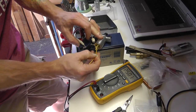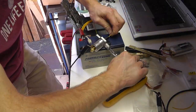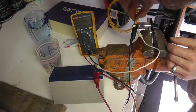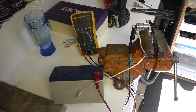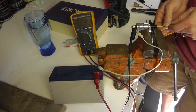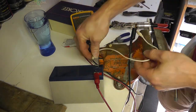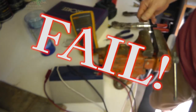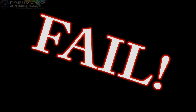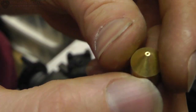After that I got the heating element all put together, and then basically tried melting the plastic. I tried and tried - more power, different plastics, all sorts of stuff. It seems like it would melt for a short time and then just quit, and I just didn't understand what the problem was. So I actually took the end and machined it down so I could fit it inside a new heating element, because I thought my heating element was not hot enough. I built a whole new end just to make the heating element actually work.